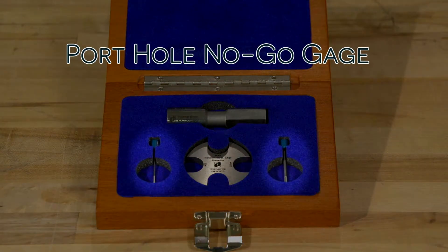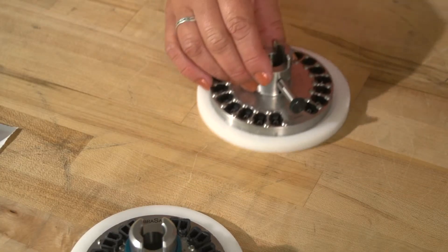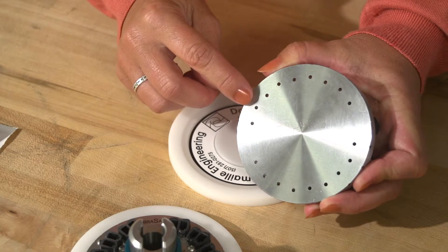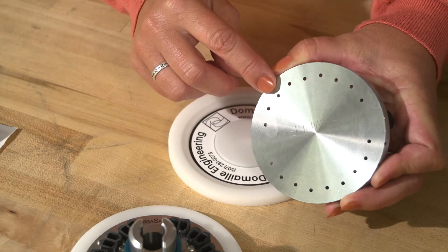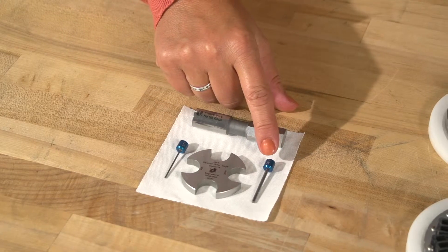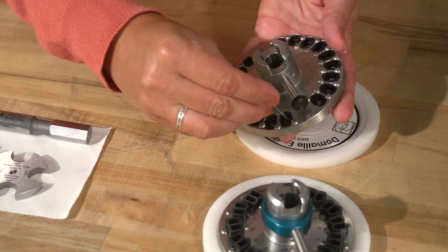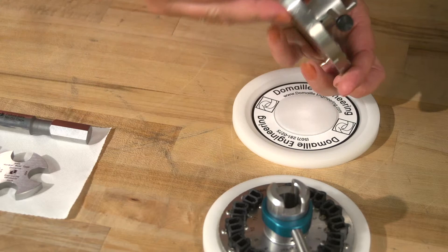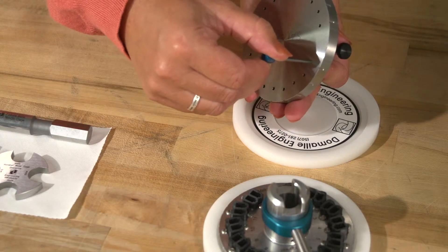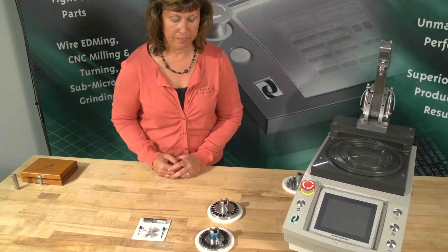Step 4: The Porthole No-Go Gauge. The Porthole No-Go Gauge measures the natural deterioration that occurs when the connectors or fiber have been mounted to the fixture repeatedly. Over time, the resulting friction will cause the holes to enlarge. The Porthole No-Go Gauge comes in two sizes, 1.25 mm and 2.5 mm, covering most fiber optic configurations. Determine which diameter is needed and gently insert the pin into the fixture porthole, checking top and bottom in multiple locations due to the possibility of an uneven wear pattern. Ensure all holes are thoroughly measured. If the Porthole No-Go Gauge fits into a hole, the fixture needs to be replaced.